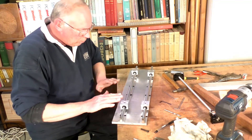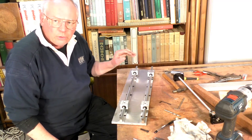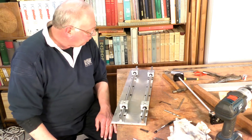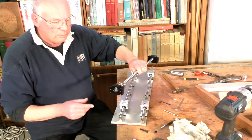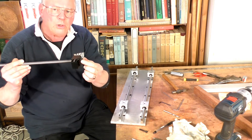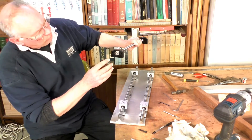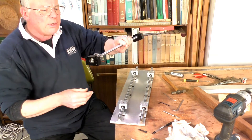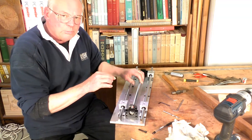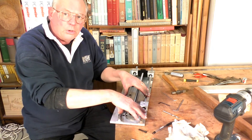I've now got both of these permanently on there and they're parallel throughout their entire length, plus or minus a couple of thou — the closest I can get it, which is good enough. I've pre-assembled this now, I've got the preloading nut on here, bearings are all preloaded up, the little lock grub screw is done up, and I've got the circlip pin on the end there. So this is ready to go.